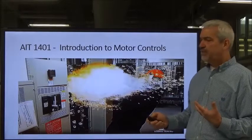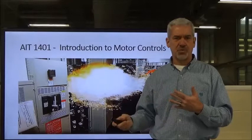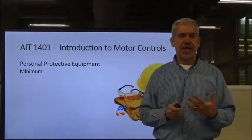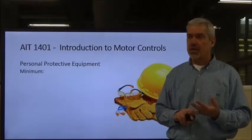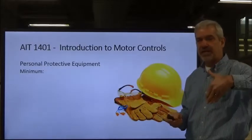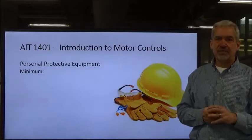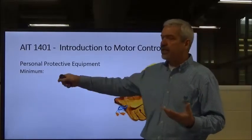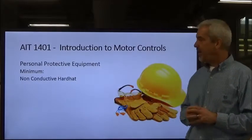That's the difference between an arc flash and an arc blast — it's where one of the phases comes in contact with each other or goes directly to ground. So when you're dealing with electrical cabinets, switch yards, or motor control centers, where three-phase voltage is distributed out to equipment on the plant floor, you're going to need protective equipment.